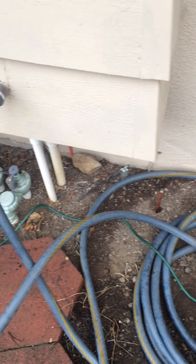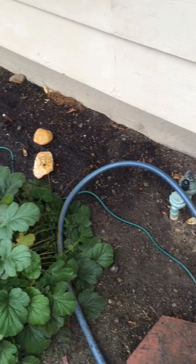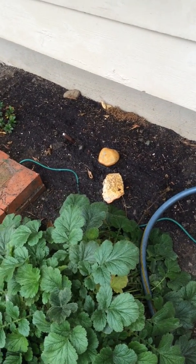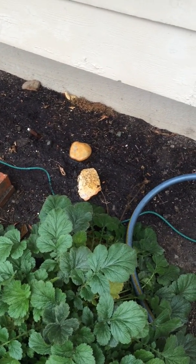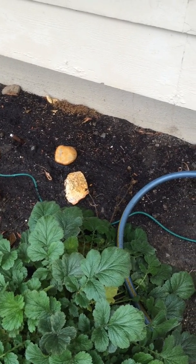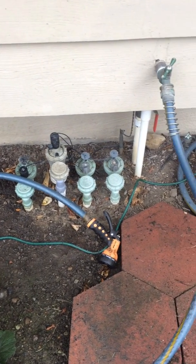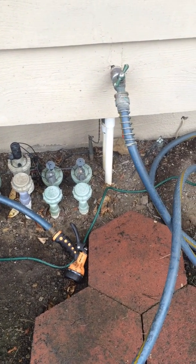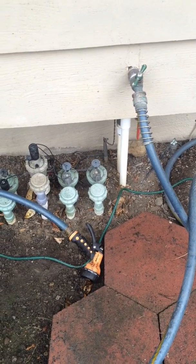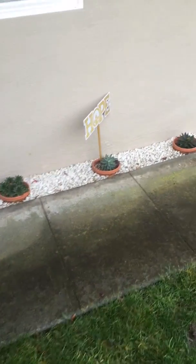You can see my other video on how to stick the ground rods into the dirt. Here is the second rod and it's six feet apart from the first one. I couldn't show how to run the ground, but you usually run it underneath the house using the crawl space from the bottom of the panel all the way to the main water pipe.